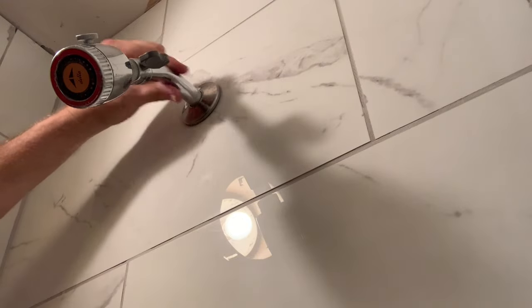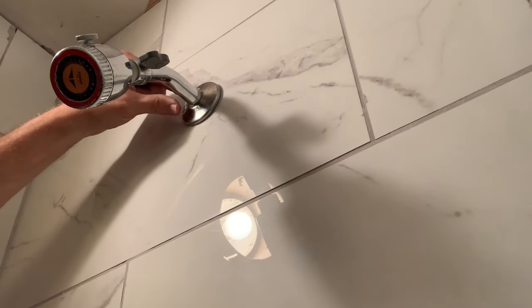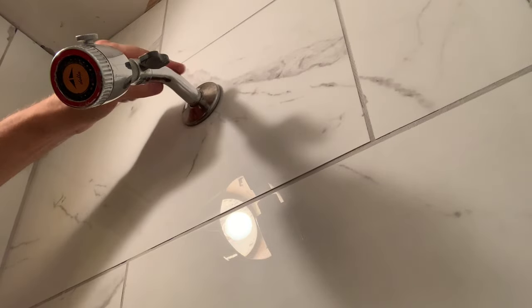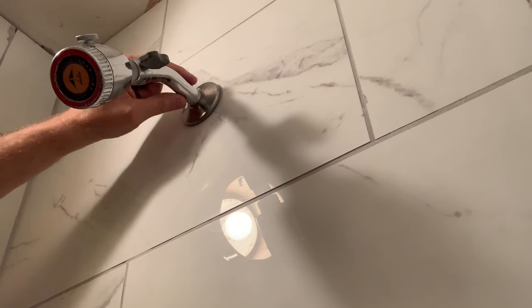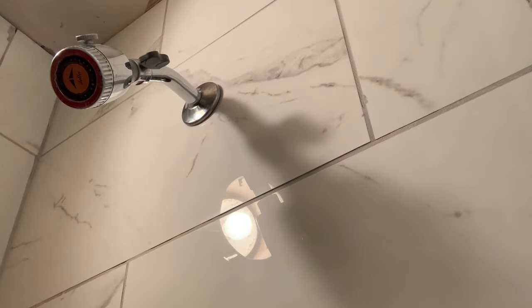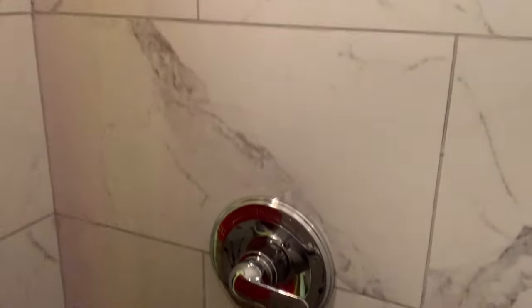We already put this in — this is simply a screw-in. It screws into the fitting that's behind the tile wall there. And this cap just pushes on next to the wall. So this is super simple, it just screws in. At the end you can put pipe thread tape, pipe dope, or pipe paste — either one of those work. That's super simple. And after you've done that, your shower is good to go.